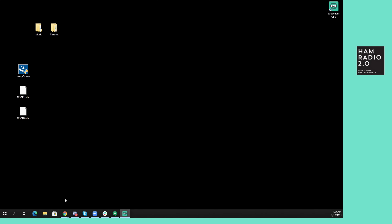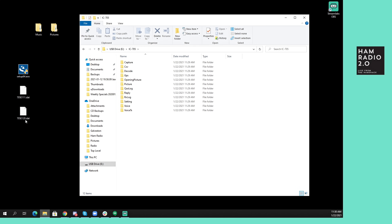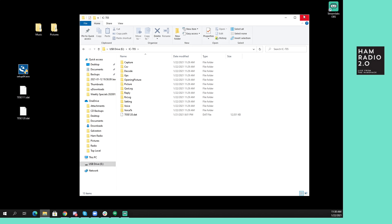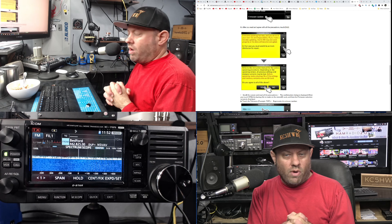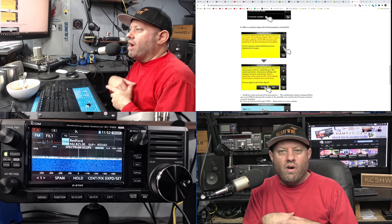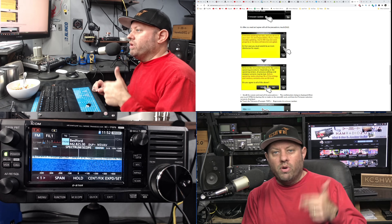Bring this up here — USB E drive. Now that it's formatted, I've got an IC705 folder. So it's just anywhere in this root folder — I'm just going to copy that right there inside of that folder, not in one of these specific subfolders, according to the instructions I'm reading. Once we've got the micro SD card formatted and the newest version of firmware dropped into the top IC705 folder on the formatted micro SD card, we take the SD card out of the computer and put it back into the 705.